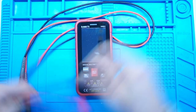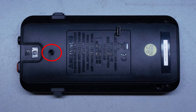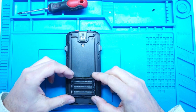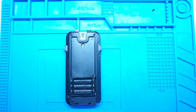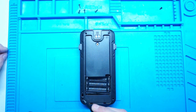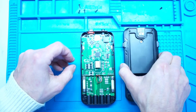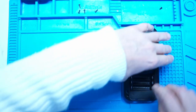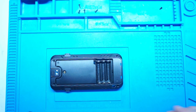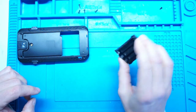Let's disassemble. Remove the measuring cables and the protective cover. Then remove the battery cover — find the single screw there. Once you open the battery cover you will see the battery clip still in place. Next step is the removal of the rear housing cover — the 4 screws are to be found here; unscrew and remove. Load your Dremel with the cutter wheel. Cut out the battery clip along its four edges and remove it from the rear housing cover. The battery clip may go now. You will have to clean the cut edges from excess molten plastic.